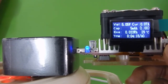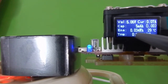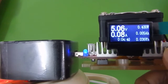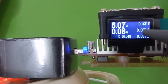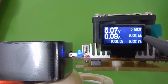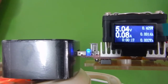Here is the time again and the amount of current we are consuming. If you press the button again you get another mode: on top you can see the voltage, at the bottom the capacity in milliamp-hours, underneath the energy in watt-hours, and below that the time. On the right side you can see the temperature and on top the current. To clear all these accumulated values you can long-press the button; you will hear a beep and all the values will reset to zero, after which it will start accumulating amperes and watt-hours consumed over time.